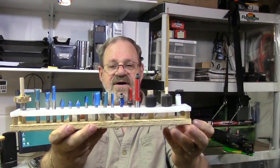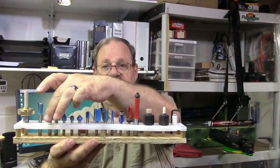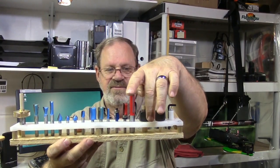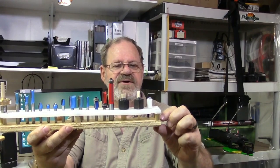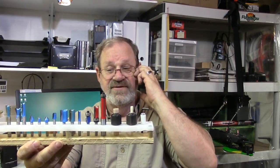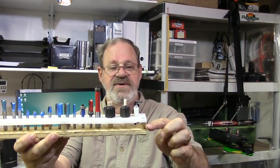What it is is cutting out this cutting board here in lengths. I did them at 15 inches — the width of the board — and it's 3/8 of an inch thick. I've got half inch plywood on the bottom. And the shortest bit shafts that I have was like an inch, so I did my spacing with these spacers here.